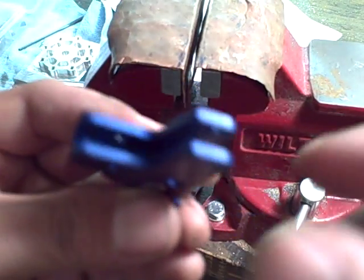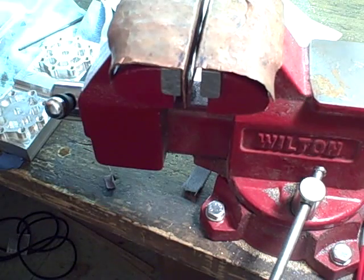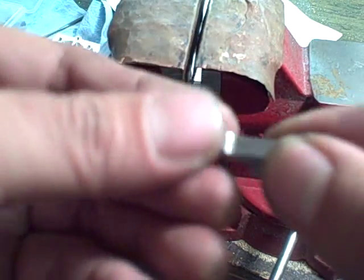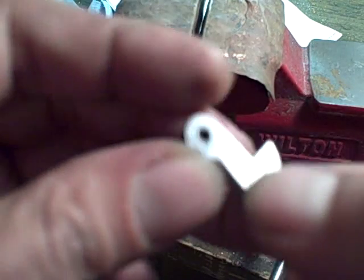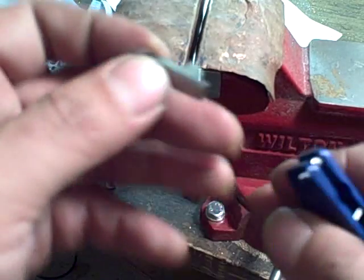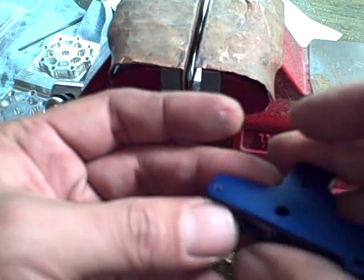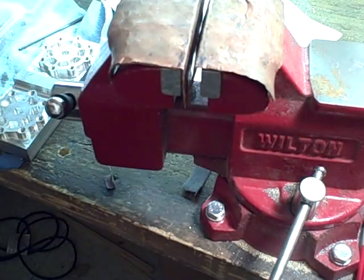Also, cleaning out the inside of here — just a light cleaning with some emery cloth — because before it had little burrs sticking out from where they had drilled the holes. Right now it slides in and out fairly smoothly; it's got a little resistance, but before you'd actually have to put some force into it. I cleaned up a little bit, and I may take this side down a little bit more, but it doesn't have to be perfect. You just want it to be as smooth as possible when it's in here, just turning back and forth — you don't want any friction on that.